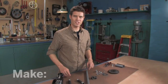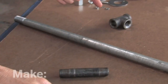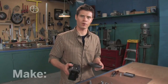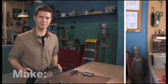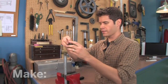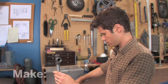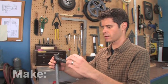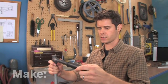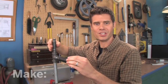Here's what you'll need to build your own Steadicam: three pieces of half-inch diameter pipe threaded at both ends, a T-joint to connect them, some assorted hardware, and I'm using a two-and-a-half pound counterweight for our camera. I'll start with this long pipe, which is the main body of our camera rig. I'll set it in the vise and screw on this T-joint so I can connect the other parts. This medium piece will be the handle, and I've got a nice little bicycle grip to use — slip this on here. And finally, this short piece will go on top, and that's where I'll attach the camera.